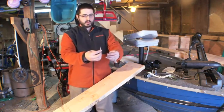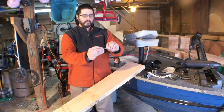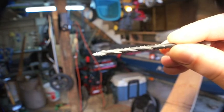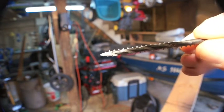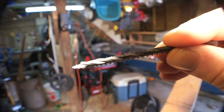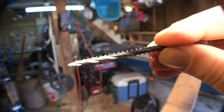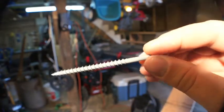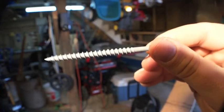So what you do is take a drill bit and your screw and put them right on top of each other. You want your drill bit to be a little bit smaller than your actual screw, because your goal is to have the little spiral threads bite into the wood without the base or center of the screw hitting the wood — that's the part you want to eat in. By the way, I'm using a 3½ inch screw. It's a deck screw — it's got a coating that won't rust and won't screw up your wood. We've got the bit, we've got the screws. Let's go drill our holes.